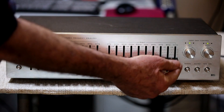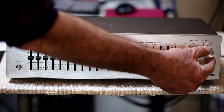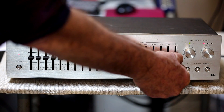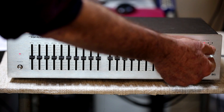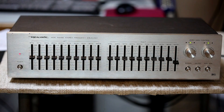I'm going to move the right channel up a few dB. You can see the LED came on and it's on the plus side. So what you would do is turn the potentiometer to the left until it turns green, keeping the gain overall at zero dB. Similarly, if I bring it back to zero, I have to readjust it — it says it's a little weak, so I come over there and it's back green. If I move down, I would have to increase it. So it tries to keep the overall loudness of the signal at the same level — that's a neat little feature, and when I do the data testing we'll see how well it works.